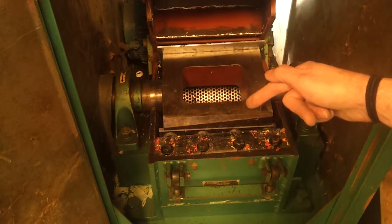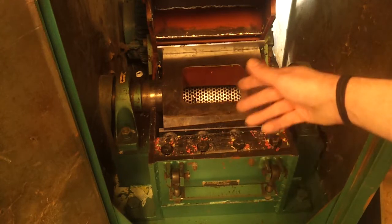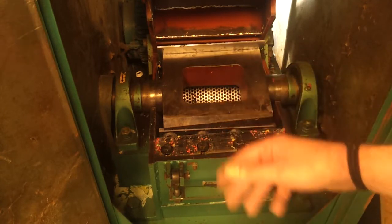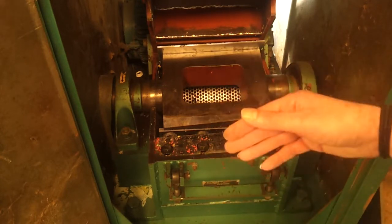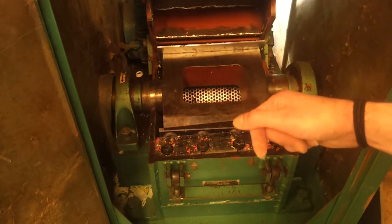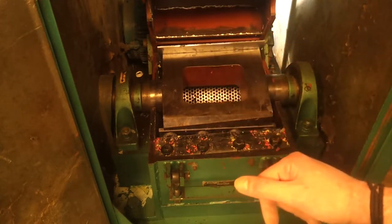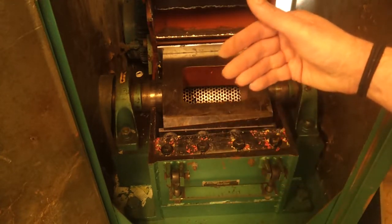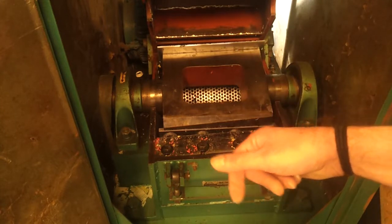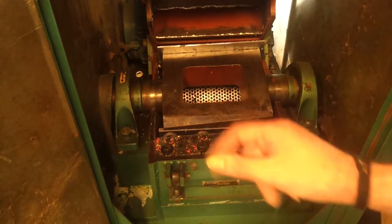So if you're running a high temperature material, you really want to clean this out properly — get in there with a vacuum cleaner and get as much of it out as you can. Ideally the next batch of material you put through should be a different colour, because then if there are any granules from the previous batch you can see them and pick them out. Put a kilo or two through just to give it a chance to move any residual granules through the system, then you can see them because of the different colour and pick them all out.